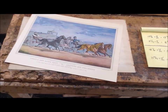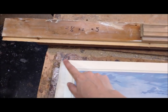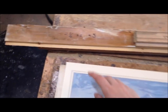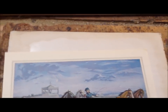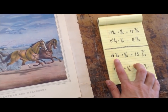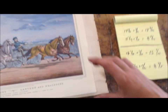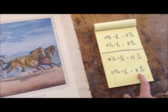There's a pretty simple formula to get miter cuts perfect every time. If you think you can just cut a miter based on the print length — which is what I first assumed — you cannot, because you have to account for the thickness not only of your material but also the rabbet. You measure your frame length and width. For the bottom frame the top measurement was 15 and a half, and adding a sixteenth for play gives 15 and nine-sixteenths. For the top and bottom it was a little over three-quarters, coming to about 11 and seven-eighths with the sixteenth added.